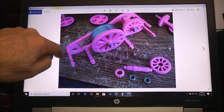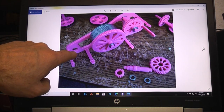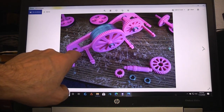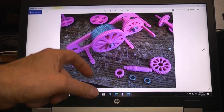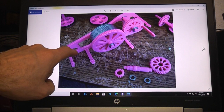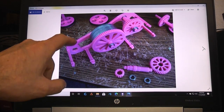One of the things I changed in the remix involves the frame. In the original design, the bearings sit in just the same diameter hole all the way through, so when you build it the bearings can just walk out either side and the shafts move. So I redid the frames and added a lip so the bearings are captured and your axles can't walk.